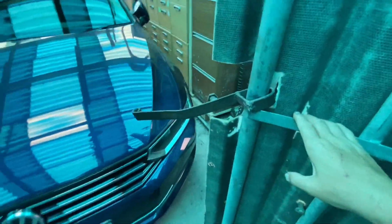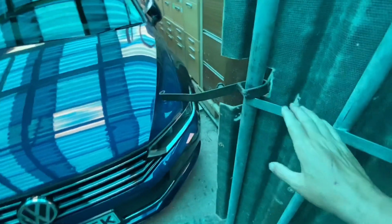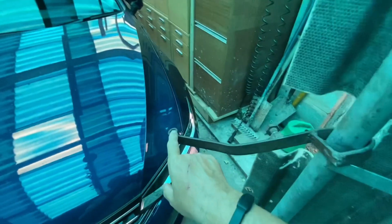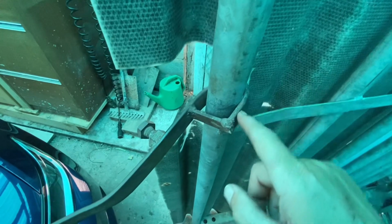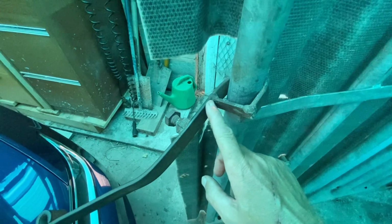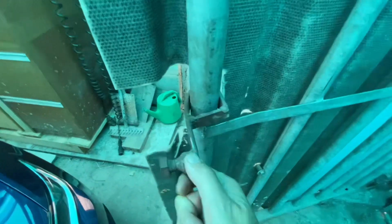But then the problem was, how do I connect them together? How do I make this door and that door connect together with a big padlock? You could have done it 110 different ways, but I decided to get one of those hinge bars, look, and bend it and shape it. I welded a nut on here, there. I warmed this up, banged it around, welded it here, look. It doesn't look pretty, but it's doing the job. It's been here for years, and that's what goes around there. That's not going to come apart, is it?